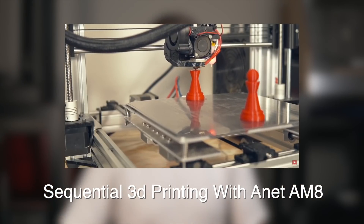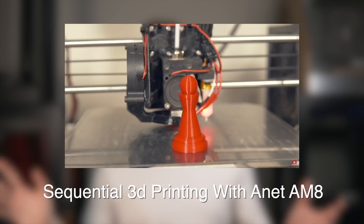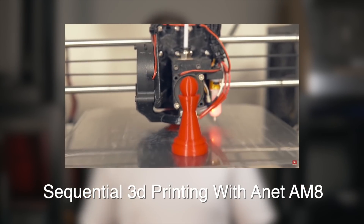Lastly, the cable management — although the cables are roughly the correct length from cutting them down and soldering them to size — I still needed to print a cover for the electronics housing. I was working on a Fusion 360 design for a different top cover that just didn't get finished, so that is kind of the final icing on the cake. For anyone with an Anet A8 interested in this conversion: three years later, this was something started when desktop hobby-level 3D printers were nothing like they are today and there weren't many options around the $200 price tag, so doing this conversion made a lot more sense than it does today.